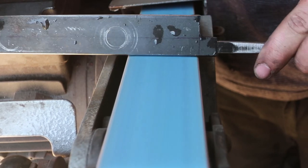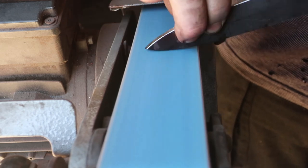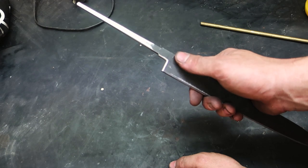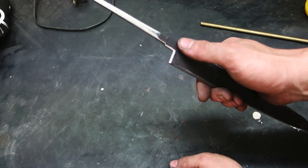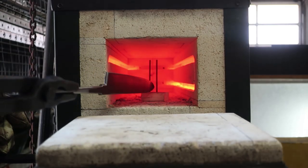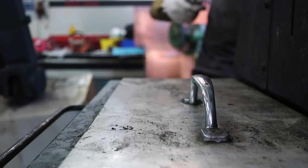So what you saw me do was round over the spine, choil, and ricasso of the knife. Now the most important part is to round over where the ricasso transitions to the bolster or handle, because if you have that hard corner, it can act as a stress riser and snap in half. And trust me, I know. Therefore, when heat treating, I round everything over except the edge, and 36 grit scratches can also play a factor.